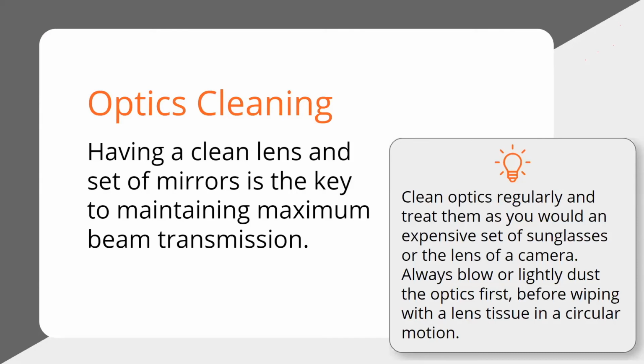So the right way to really do that is you can take the mirror 3 mirror out. If you look at the top of your laser head, it's got a little boomerang shape, like a little silver boomerang piece. And it's got these tiny little Allen bolts that hold it in. If you remove that boomerang, then you can just pop the mirror out and clean it. Now, there are other bolts up there and there are adjustment knobs up there. You do not want to touch those. Don't take the whole bracket off.